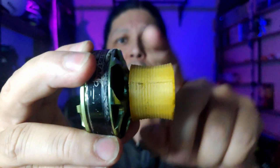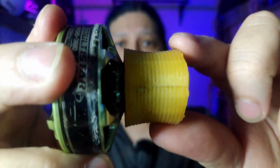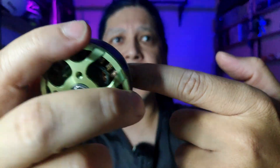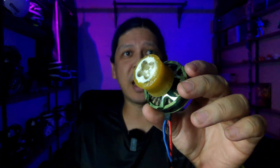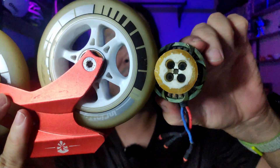When I went for pancake motors, I scratched the belt drive system and started working with a friction drive system, which means I have this part here attached to the motor, and this part here which is 3D printed and covered with polyurethane inside a mold, and this part goes directly in contact with the wheel. So when the motor turns, the wheel turns as well. The main thing here is torque — the difference between the diameter of the drive wheel versus the skate wheel dictates how much torque I have.